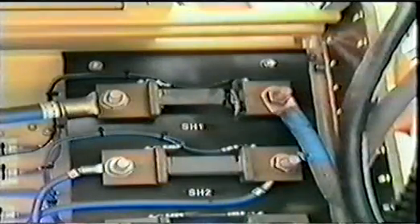This is the output shunt in the first rack and in the second rack. But as you can see here, there has also been some damage to the minor wiring close to the shunt. Similarly, all the other rack shunts had fused, and some minor wiring damage had been caused.